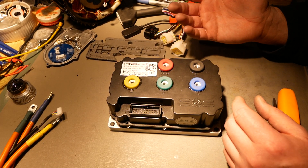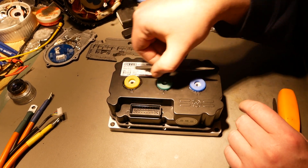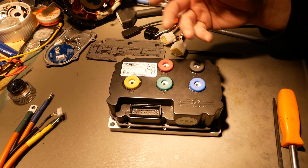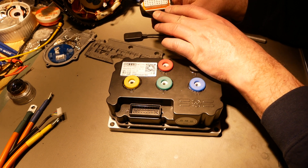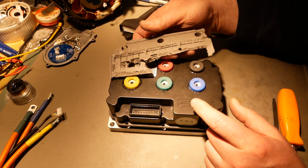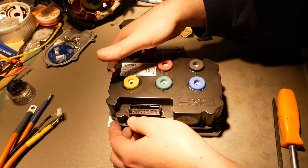At least like with the ASI BAC 8000 or the EBMX X9000, they have fins between all this stuff so that shorting is much harder to do — and definitely a plastic cover over everything. They could have done that here and they didn't. This main connector right here does have a silicone seal, so it's fairly water resistant — it can go through a puddle or get hosed down and it'll probably be okay. Everything was all potted, so pretty much waterproof-ish as far as that's concerned; they were completely depending on the potting for waterproofing.